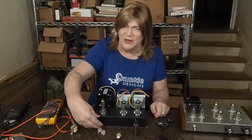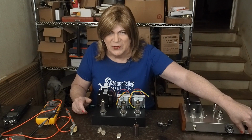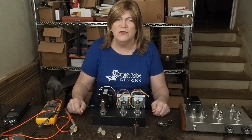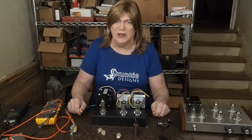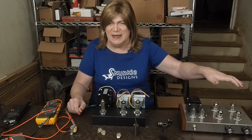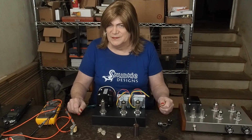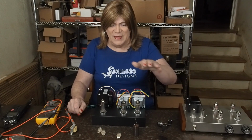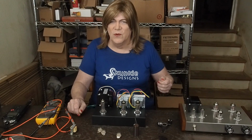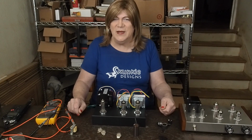I mean, if you're having to turn the volume on your amp all the way down to like 1/10 the volume so that you can actually use the volume knob on your preamp, or you're only using like the first 10% of the knob on this, none of that makes any sense, especially when you think about how tube amplifiers work and that the gain is pretty much preset and that the volume knob isn't changing the gain, it's just changing how much of the input signal is sent to ground. And if you've got a bunch of gain here and then a bunch of gain here that you're attenuating to ground, you're just going to have a bunch of noise and distortion added to the signal for no good reason. Or maybe I'm crazy, but that's the way I see that.